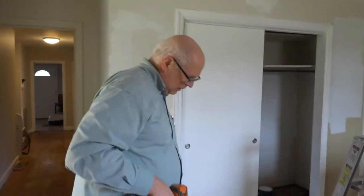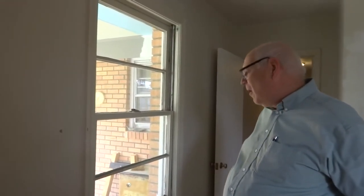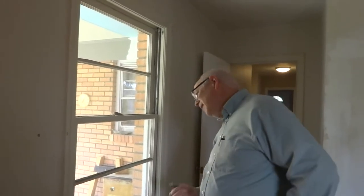We need to pre-drill because this house is really old — about 60 years old. When they build houses in the United States, the wood is only partially dried; it usually has about 30% moisture in it. That makes it easy to drive fasteners when building, but as it ages it gets drier and hardens up. So you pre-drill so the screw will actually go in.